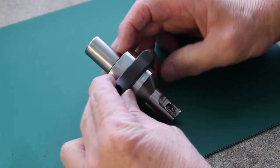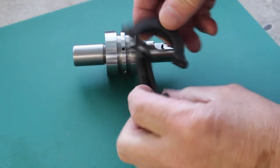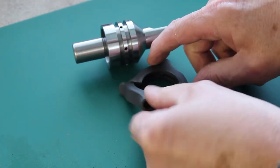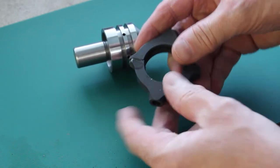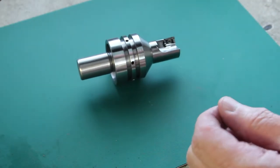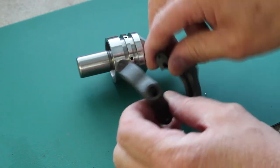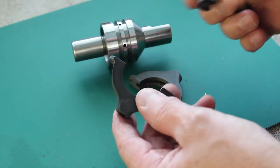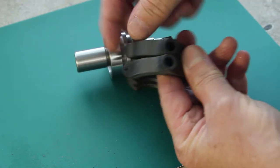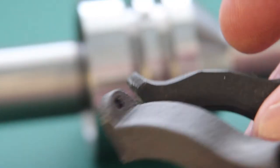Right, over at the bench here, this is the original arrangement for these saddles. And the problem was, as you saw, it leaks like a sieve, and there's not really enough clamping force, to be honest. So moving that one away, I've had another go and I've reprinted another one. However, I want to show you the difference. The very subtle difference is exactly the same dimension-wise and part-wise, except I have done away with a fillet here and put a 2mm hole in.